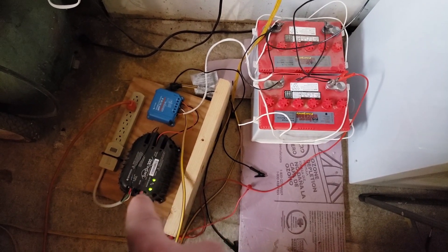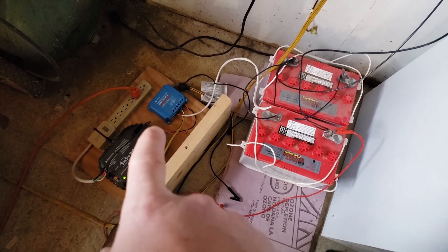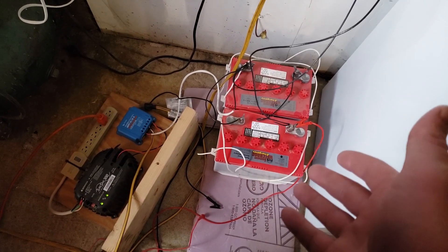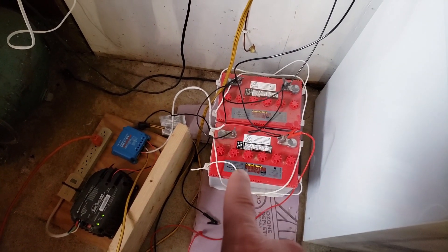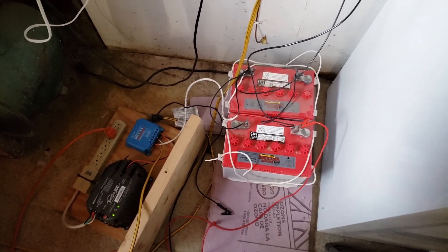So that's 10 amps going to an inverter — 10 amps at 12 volts is 120 watts maximum. I can only pull off 120 watts even though we're making 260 watts right now. I have that acting as a low voltage disconnect — it protects the batteries like last night when the nozzle blew off, set to a higher, safer, longer-life battery disconnect voltage. I have a 100-amp Victron low voltage disconnect coming, so I should be able to wire that up with a proper 1000-watt inverter and actually run things off of this system.